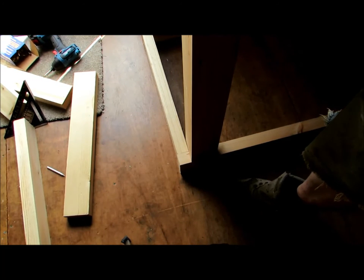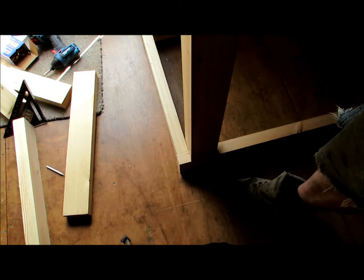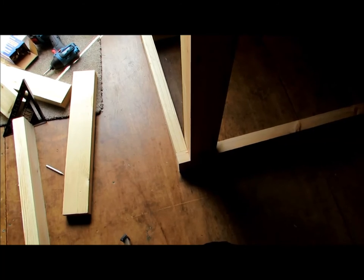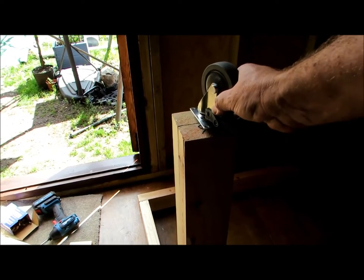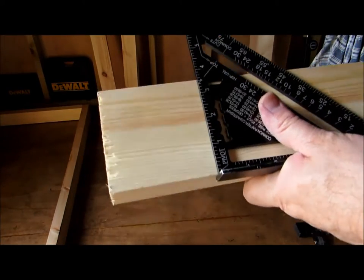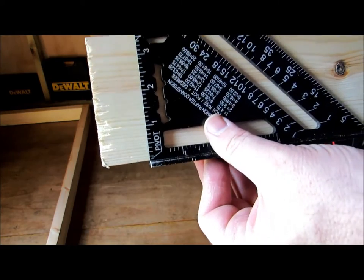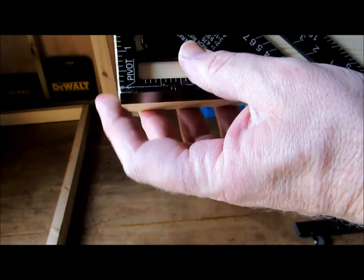It's just about right, I hope. The important thing of course is to get this spot on on all four legs - it's okay to get one leg spot on but you've got to get them all level. Then what we're going to do on the top - and I incorporated this into the height measurement - is put caster wheels. Sometimes when you get timber back from the shop the ends aren't quite level; if I use my carpenter's square and just butt that up nicely to the end, on this side you can see it's slightly proud, about a millimeter, millimeter and a half.